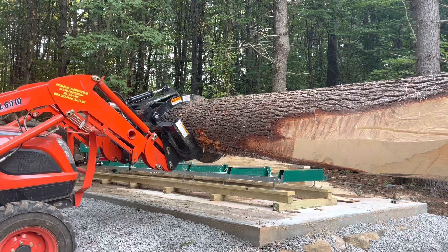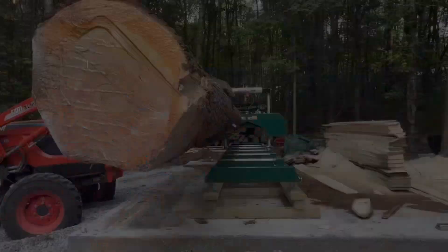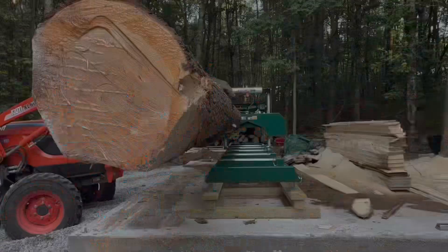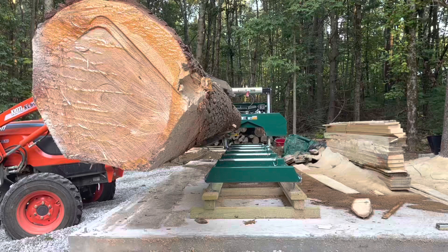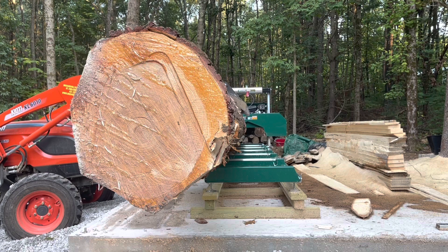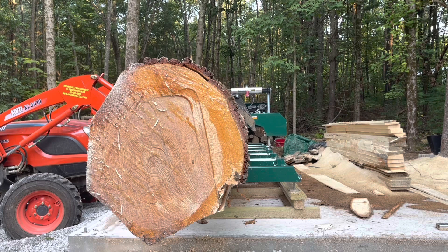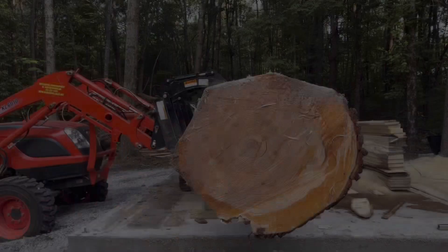Manual push mills are a lot of work, even with big equipment like a Coyote NX4510 — there's a ton of manual labor involved. Coming up is one of my favorite shots: releasing this huge 3,000-pound white pine, catching it with the grapple, then letting it roll the rest of the way. I do that to minimize damage to the mill — 3,000 pounds of force pushing against it could move it, tweak it, break it, or bend it.